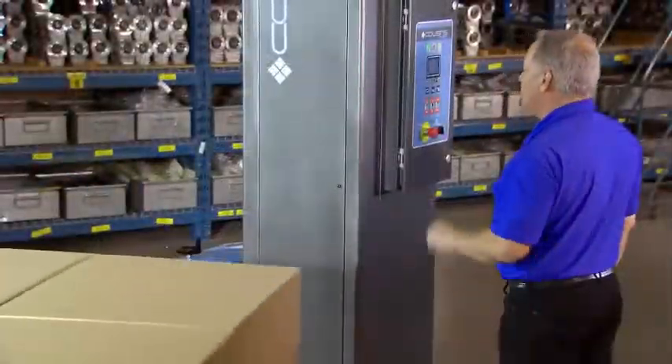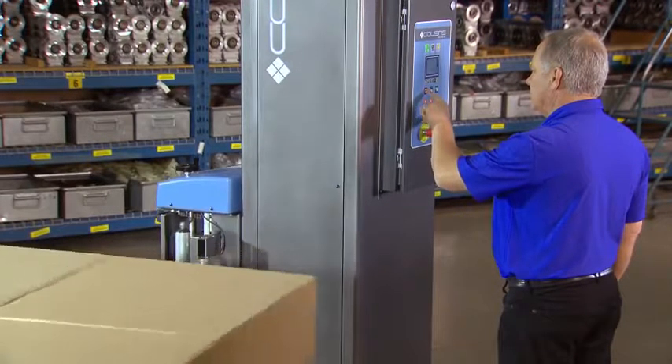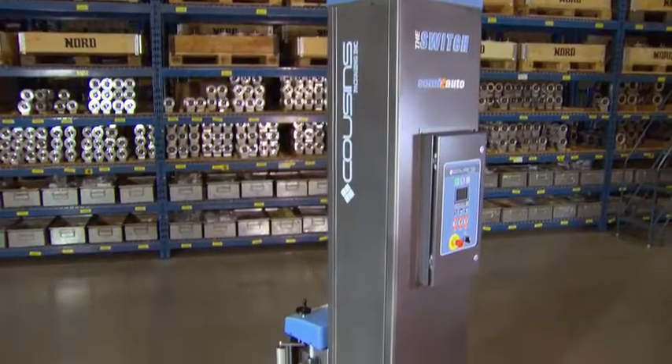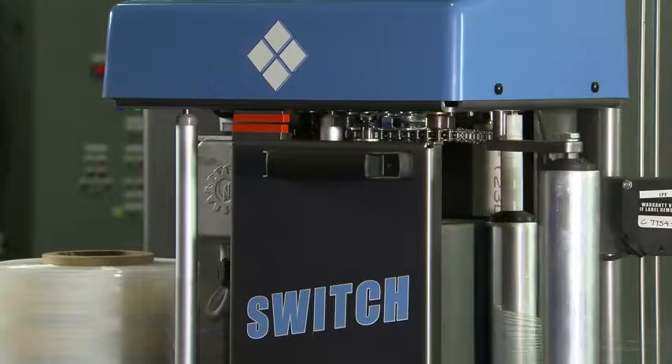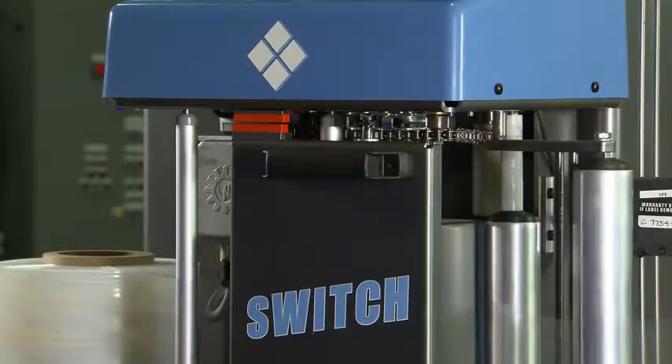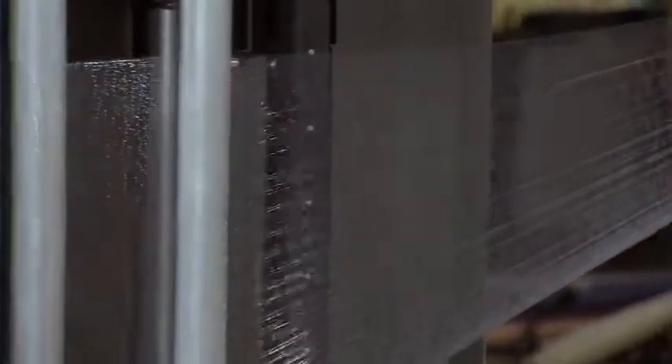It has the largest pre-stretch roller to film contact area of any machine in the industry. Mounting the carriage on the opposite side to the operator achieves a very important objective: operator safety. The new Super Rapid Thread 2 is the only carriage mounted on this side that puts the sticky clean side of the film against both the pre-stretch rollers for optimum stretch and the inside of the load for maximum hold.